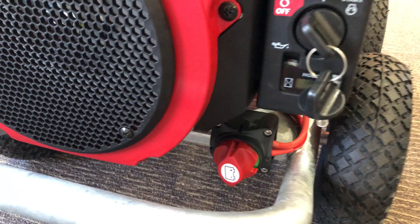These all have the digital hour meters and oil lights now so you know when the service is due. Moving around the side here to fill the oil, we've got an oil point here. You should check the oil levels daily through the dipstick point here.